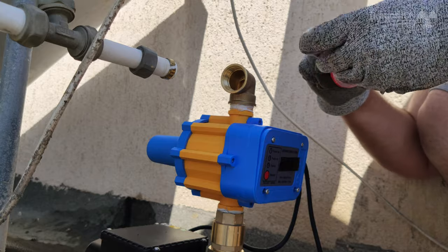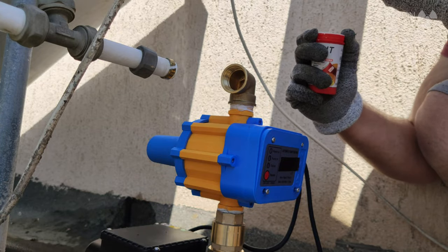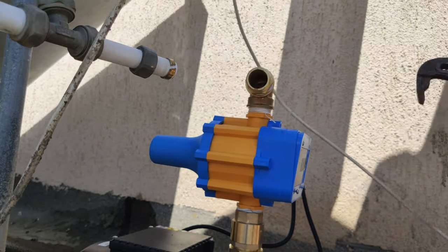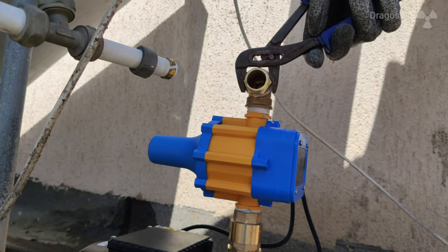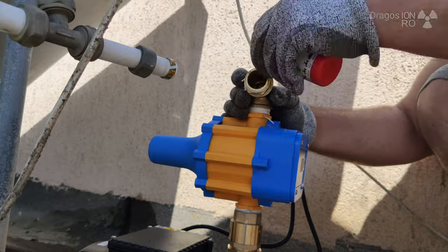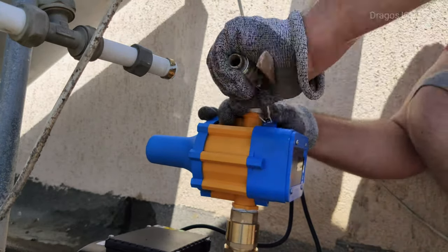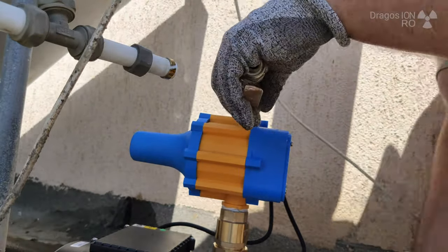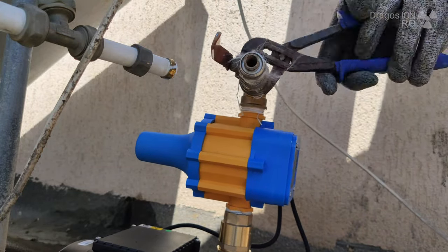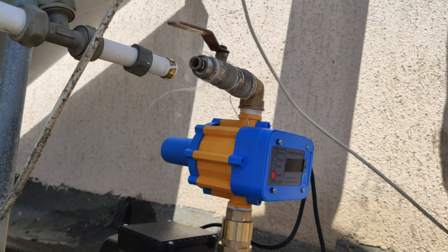Here also I have a nipple fitting. This one is just to convert, to be able to fit the old pipe to the new adapter. With the tape I just use the pipe wrench - it's really useful, so many uses even on the car. I put the sealant tape here also. I twist it by hand - this gets pretty hard at some point. I just want to make sure this is not going to leak from these areas. Adjusting so that the valve is the same position as before, nice and straight on top there.